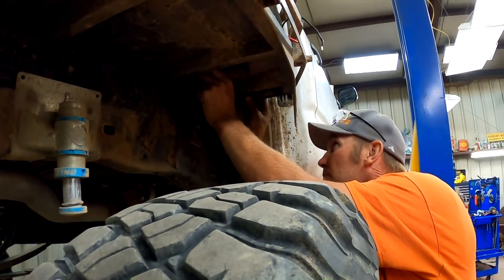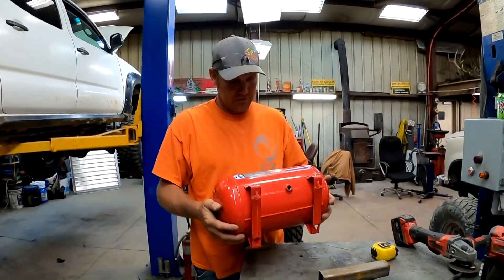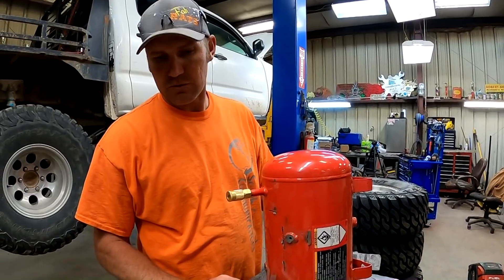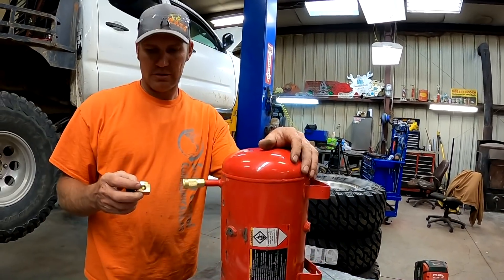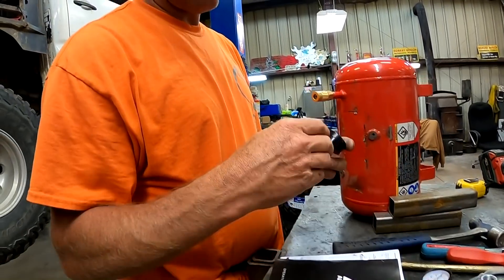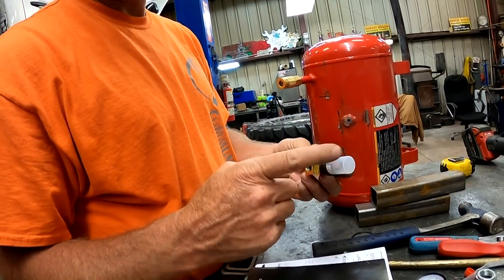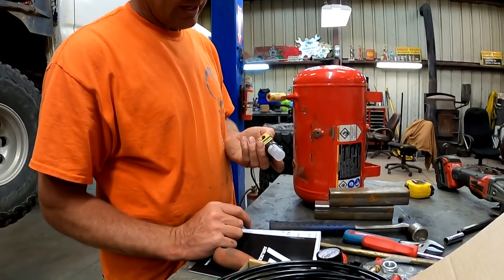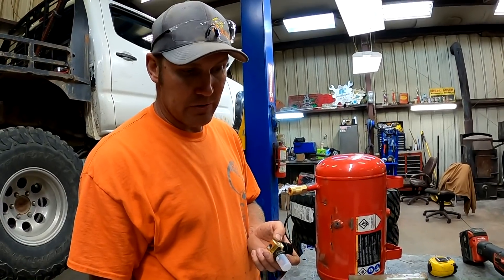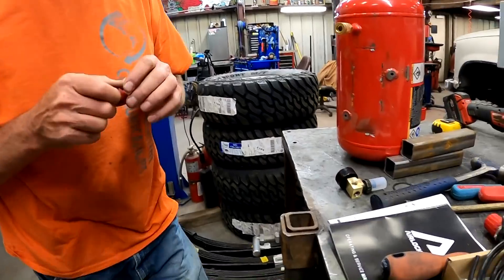Yeah, that's gonna work really good. Now we'll drill a hole in the bed, run the main line right down through, plumb it into here — this will be where the chuck is. What we're missing is this little thing — this is my pressure switch, so it's gotta go in. That's what kicks the pump on and off when it needs air. Then I gotta have a feed line going to my front. I think we just cut it off — I think that's the right thread by chance.